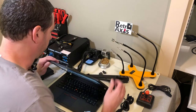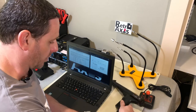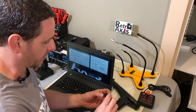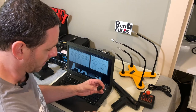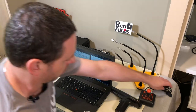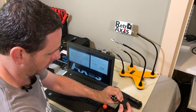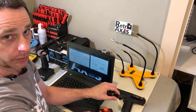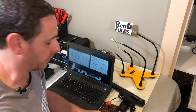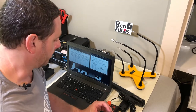What we need to do is take a cable — I'm going to cannibalize the cable off of this Sega light phaser. I'll solder it onto one of these connectors so that this end will go into the Spectrum as a female adapter, and then I'll be able to plug in an Atari joystick into the female connector. It'll allow me to adapt the pins by simply rearranging and crossing the pins over from one connector to the other. Hopefully that'll do the trick — I don't anticipate any real challenges, so let's get to it.